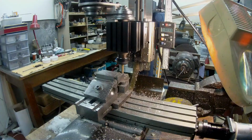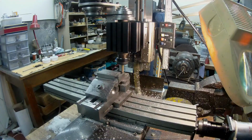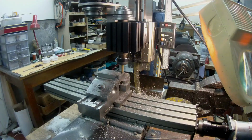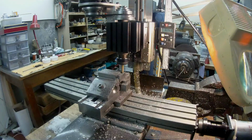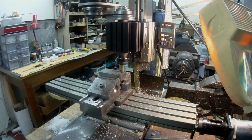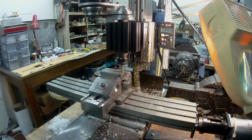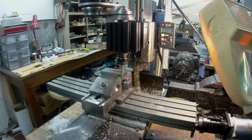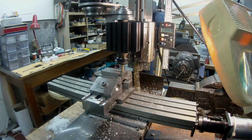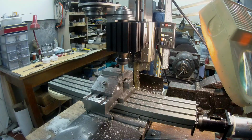But okay, I'll go down to 260. That's a 60 thou cut. You know, this is just a tiny milling machine, and I don't consider that is a light cut for a machine like this. It's quite amazing. Really nice little milling machine, really. So both their products are good, I think, anyway. So we're now down to 263.